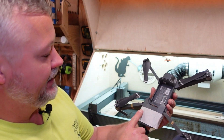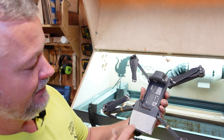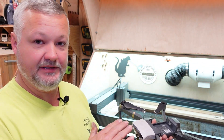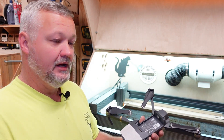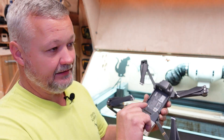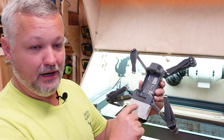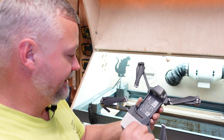I've got me a piece of masking on here and I've marked the center of this little flat area. The way I'm going to do this is — because I don't want to have a collision with the rotors that sneak up a little high — I'm going to use current position and set that little dot right there, and select the appropriate dot on the current position to indicate that my laser is directly above where I want the text, which will make it drop down into this area and engrave here.